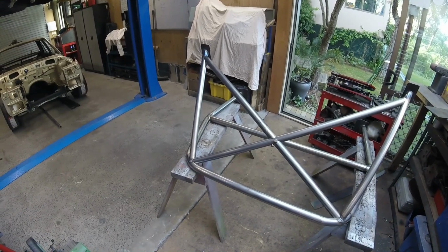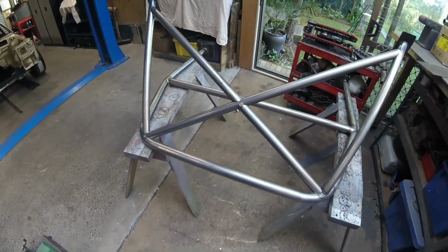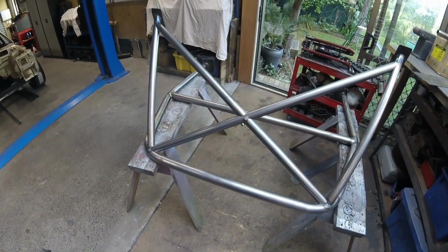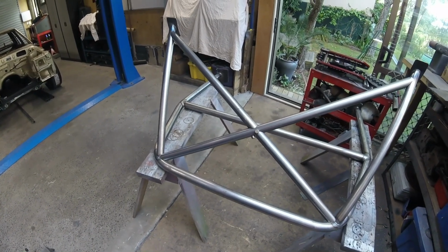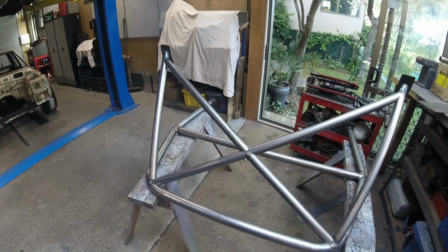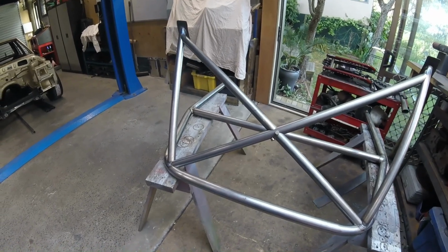They work quite well. A couple of issues there though with TIG welding. These magnets here I'm talking about. TIG welding, the plasma, electron flow, whatever, off the tip gets a bit mucked up by the electromagnetic field, or magnetic field, and things go yucky, so you can't weld too close to the magnets. It's only good just to hold it, just to tack it, and then you take the magnets away and carry on.